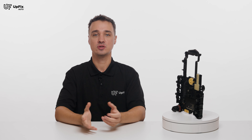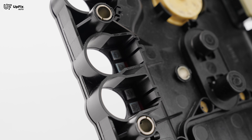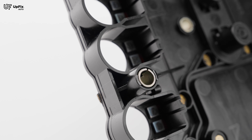Each speed sensor will display a specific set of trouble codes which will allow you to determine which sensors are faulty. The unique design of this TCM can be attributed to the way it mounts to the valve body. As you can see on this unit, there are deliberate circular gaps along the outer edges for the valve body solenoids.